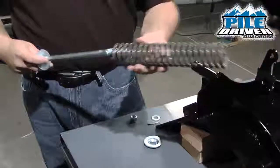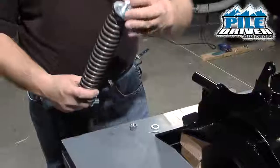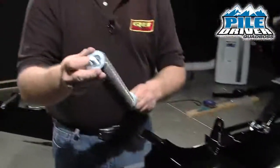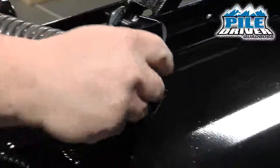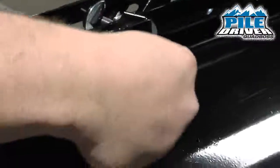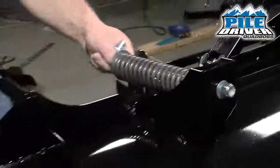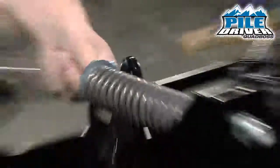The first thing you want to do is put the spring onto the shaft, install the retainer, and then move over to your blade. Next you're going to insert the shaft onto the blade, add the washer and the nut. You're going to need to use either a socket or a wrench to compress the spring so that you'll be able to insert the bottom of the shaft onto the wear bar.